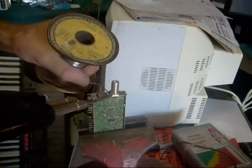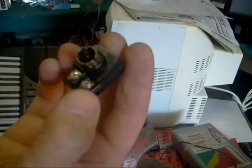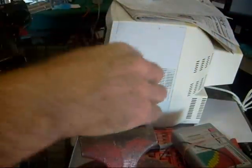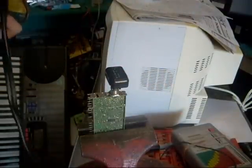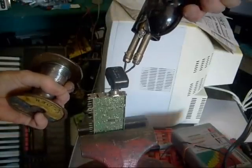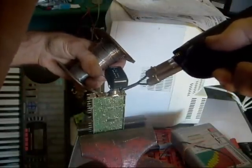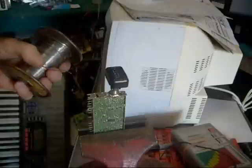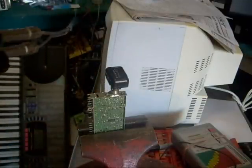Unfortunately I've got a little bit of a gap there I'd rather not have, but as long as I don't short out that center terminal, I'm good. Now this is a little trick a friend taught me — he generally likes to take an antenna connector and pop it on here as he's soldering it. The reason he likes to do that is sometimes the plastic inside starts to get molten and soft and gets pushed to the side because you're getting it so hot. That's probably not a bad idea, so I'll go ahead and do it this time. Solder is flowing on there real nice — I bet this thing's a whole lot stronger than it was when it was first made. I've never had a customer bring one back for a second repair.